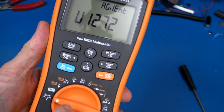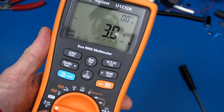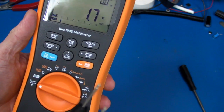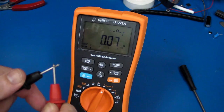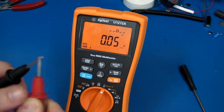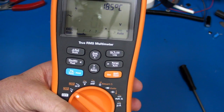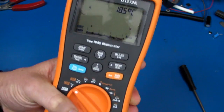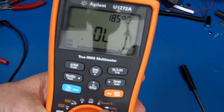Let's try it again — the low impedance mode. Three volts. So much for low impedance mode getting rid of ghost voltage. Look at that. Buzzer's working, and so is the visual audio alert indicator. Okay, that's volts mode after about five switch-ons — it just goes crazy. It seems to be a bit random.